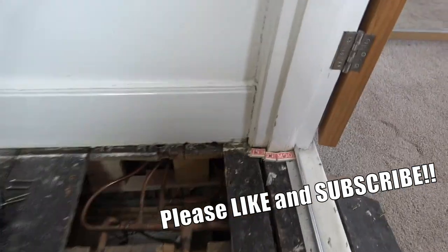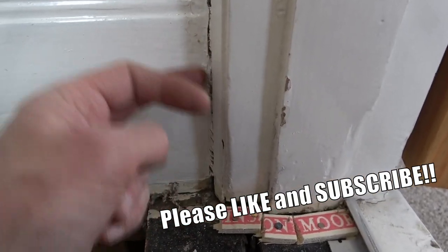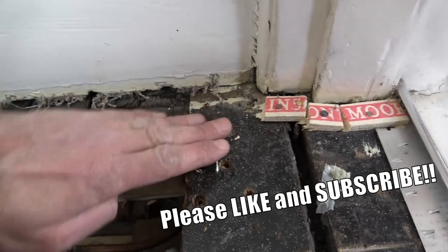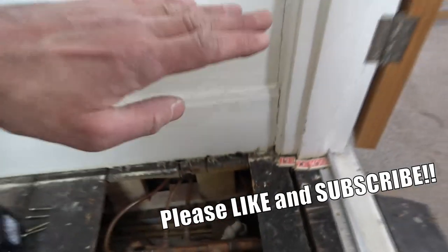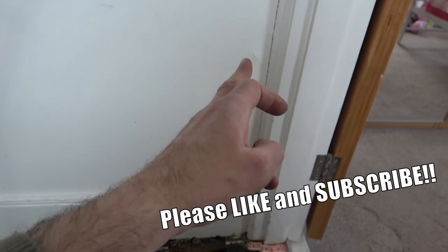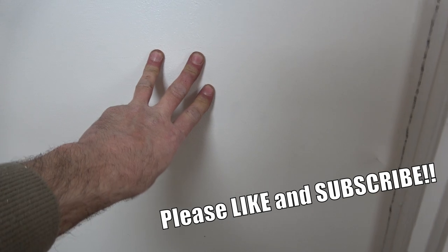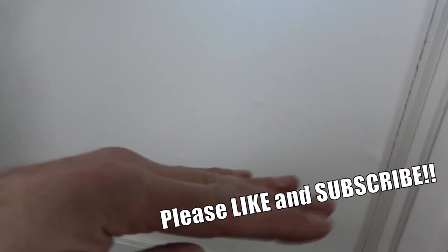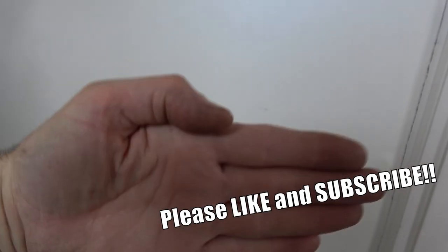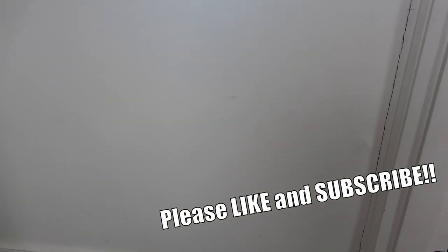Right on the end you'll notice there's movement here over the years. What's happened is the floor has basically sagged a bit, and as a result the weight of this brick wall is trying to tilt down and pull away from that wall. Now this brick wall here — I know this because I took the house to pieces — is built with the old Victorian bricks turned up on end. So it's effectively the equivalent of a modern-day stud timber partition wall.